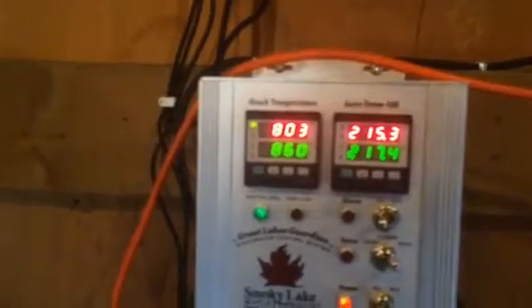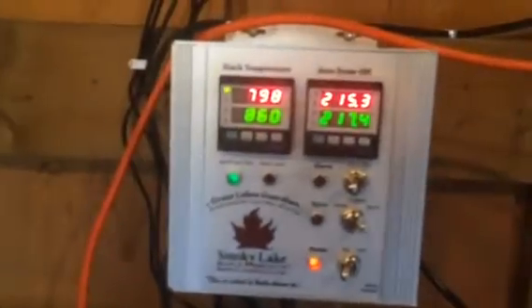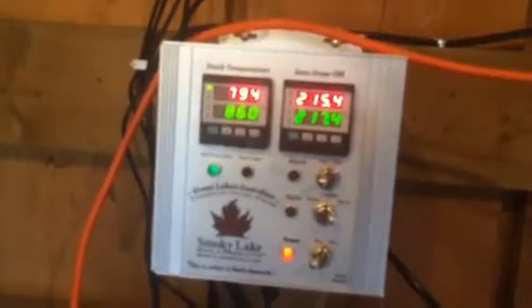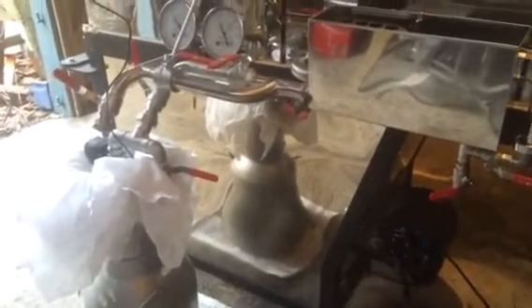This is an airtight system of forced air. The stack temperature — from the pipe there, which is where exhaust heat exits from the firewood — is about 796 degrees Fahrenheit right now. This fan down here is turned on, pushing air into an otherwise airtight firebox called the arch. I'm going to turn the fan off so that we can open the firebox, otherwise we may get seared with hot air and ash.